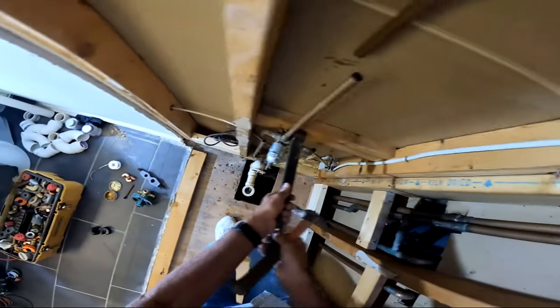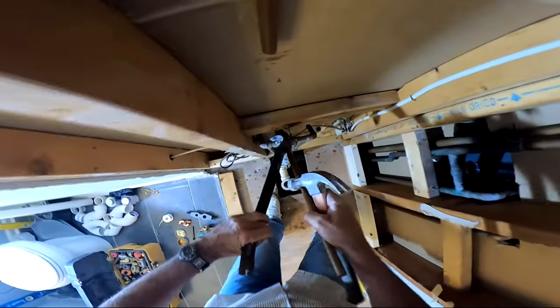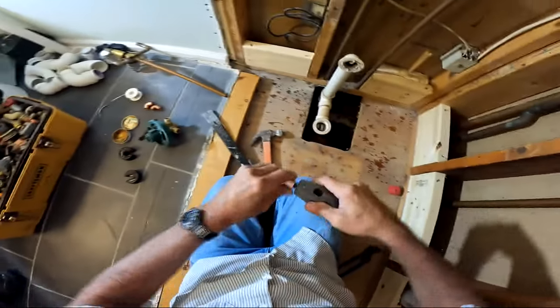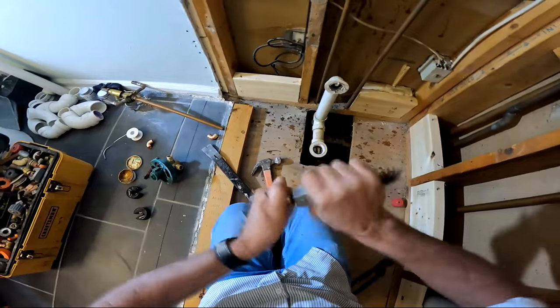Anytime you work with water, shut down the water — it should go without saying, but I have to say it anyway. I always shut down the water to make sure I don't have a pipe issue in my customer's house. I'm sanding off the ends because I know I'll be attaching connectors there. I cut it exactly where I need it for the new valve going up the standpipe to the shower head, and I dry-fit all the copper before ever sweating — all my 90s, connectors, and the valve itself get prepped, sanded, and fluxed.